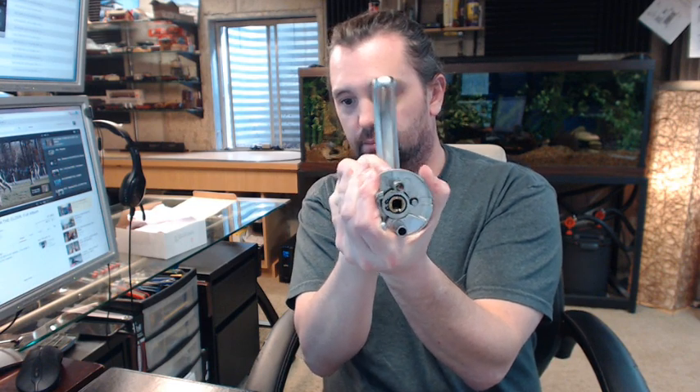Looking at the rest of the description in conclusion: you are going to be dealing with doors that work from 1-3/8 to 2.5 inches thick. Based on the length of the bolt and how the inner and outer bolting mechanism telescopes, I would have no reason to believe this would not work for a door up to 2.5 inches thick, but 1.75 and 1-3/8 inches is what you are going to be dealing with most. The levers are installed vertically only — they cannot be installed horizontally. They are just not going to work that way, as it is only manufactured to install vertically. 10 degrees from vertical to unlatch.